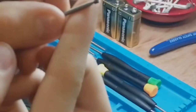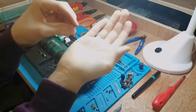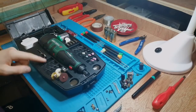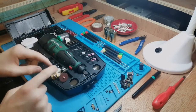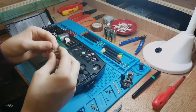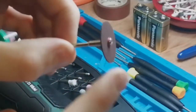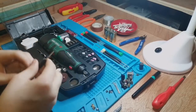The tool also comes with some router bits — just little spiral cutters. There are engraving bits, though I won't be doing much engraving. There's a brush, and a wire wool brush which I'll be using most of the time — I need to order more of these off eBay, you can get a pack of 20 for about £4. There are small drill bits too, which is good since they often snap. Shame it didn't come with a drilling chuck, but the collets will do fine. There are felt pads and a mandrel already fitted with a cutting disc — it's basically a shaft with a screw and two washers.